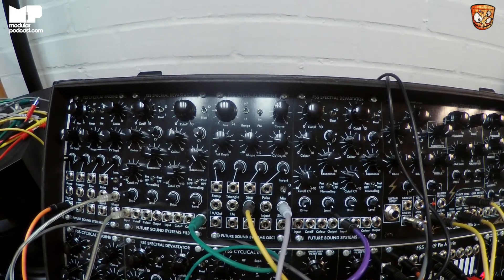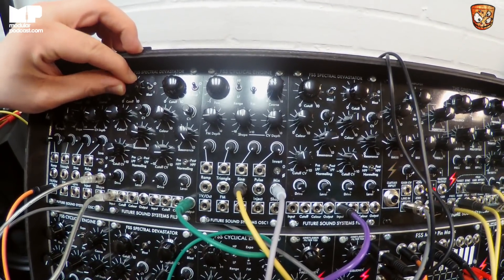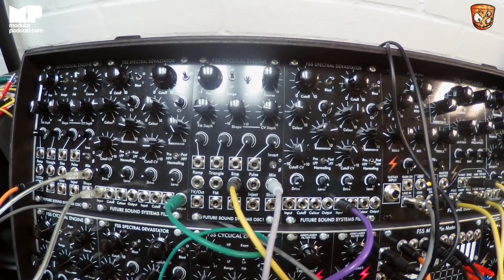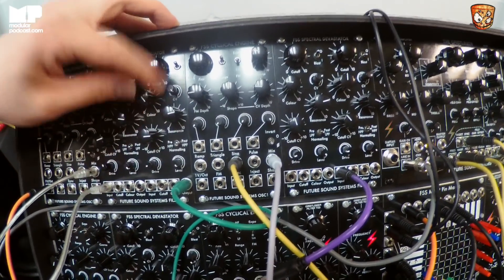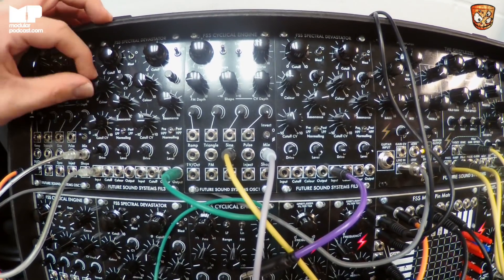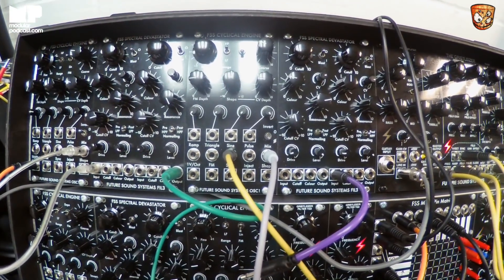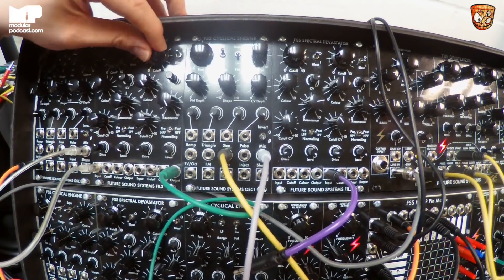And you get all of these interesting sub-harmonic and harmonic locking features — so it will really tear up anything that you put into it. We've got colour controls on each filter, which were implemented trying to get voltage control over resonance. They will do that to a degree, but they also introduce a tonal variation. There are plenty of sweet spots depending on what you're feeding in. We've also got this blast switch, which tries to linearise the filter core — and whilst it does that, it gives the resonance more space to breathe, so you get more obvious resonance.